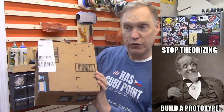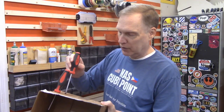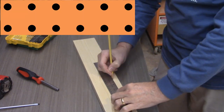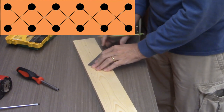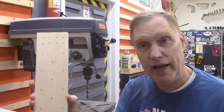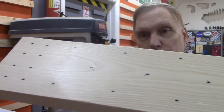So there are five places for me to put screwdrivers. Now I can test out my theory as to whether or not this is spaced properly just by dropping in some screwdrivers, and it looks like it's pretty much what I want. So now I know my measurements and I can take my template and trash it because I can go ahead and drill. Laying everything out is pretty simple — just two rows of holes two-and-a-quarter inches apart. Then connect all those dots with diagonal lines, the X's I was talking about, and those X's will show you where the center row holes need to be. Everything matches — it's almost like we knew what we were doing.